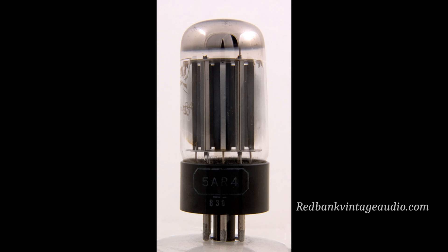That is actually a good thing because it allows all the other tubes in the amp to come up to full temperature before they see any appreciable high voltage, and that makes those tubes last longer.